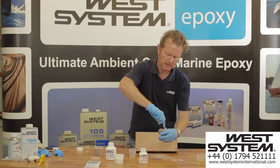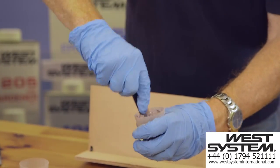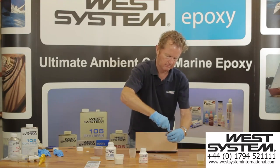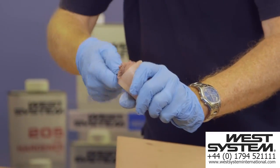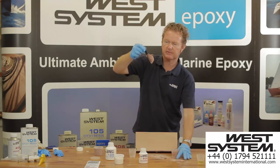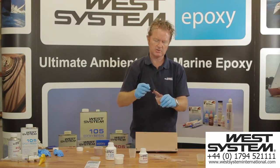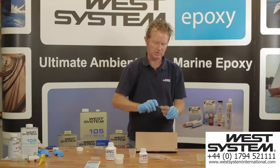You can see now it's actually starting to get nice and stodgy. And you see from that almost impossible looking blend of filler and resin hardener mix, we've now got, almost instantly, a very nice smooth but very, very stable filler mix. You can see how this hangs on the mixing stick and doesn't fall off, and it creates nice peaks that don't slump. That's very important, because we don't want our fillet to slump into an odd shape.